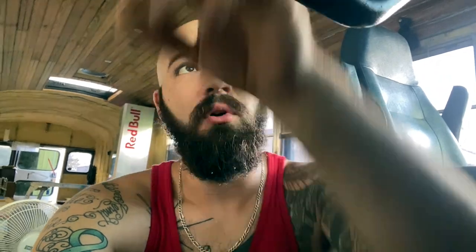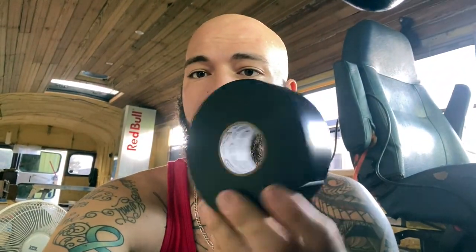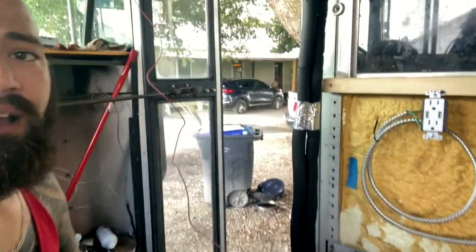Instructions that came with this unit say to hold a vacuum for up to 15 minutes or more. So my timer is on. Once we reach that 15, 20 minutes, I'm gonna turn the vacuum pump off. I'm gonna close the lines and make sure it holds a vacuum before I let the Freon in. As I'm waiting on this vacuum pump to evacuate the system, I am going to be wrapping the lines with this, it's electrical tape pretty much. The instructions say vinyl tape, but this is vinyl tape. So if you haven't figured it out yet, I am far from a professional.